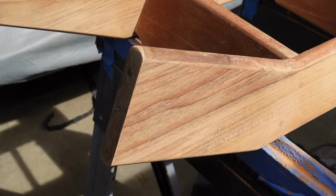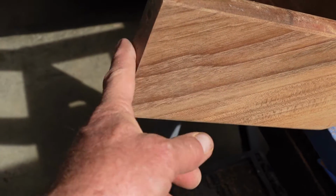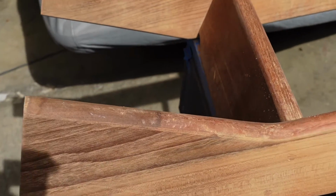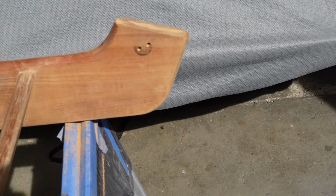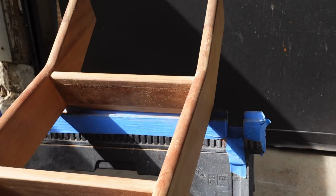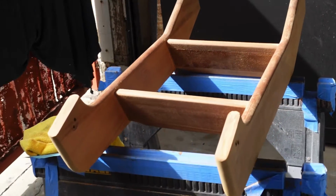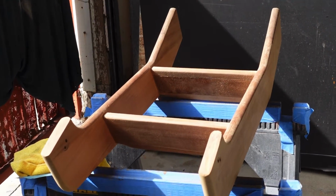After. When you're sanding the stairs, if you ever do, if you sand these down, make sure you don't take too much material off of these ends. They're not even, they're custom sized to the boat. So even a small amount of material removal will change the fit, and you'll have wobbly stairs or uneven stairs, and that you do not want. Trust me. I've been on boats where the steps are uneven and wobbly, and it's freaking dangerous when the boat's rocking around. Yeah, not good.